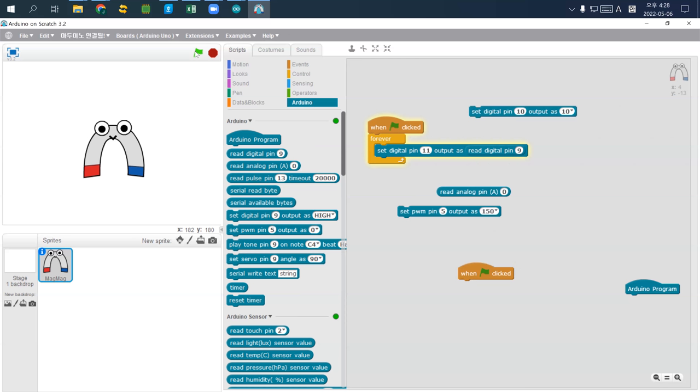Okay, I'll light up the servo motor. Everyone got a servo motor, right? So this is the servo motor. As you see, sensors and output devices may or may not have three cables. And what does that mean? Two cables need to be connected to 5V and ground, and the last one is a so-called controlling cable, which is the signal.